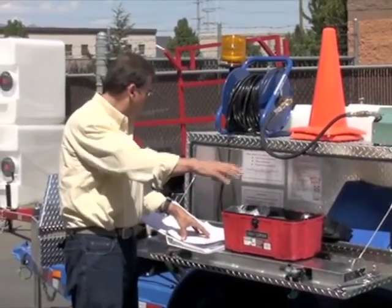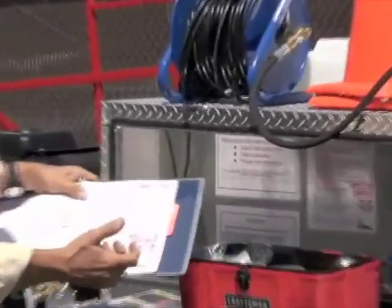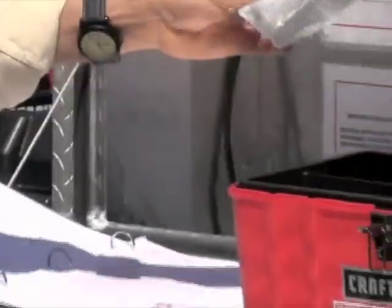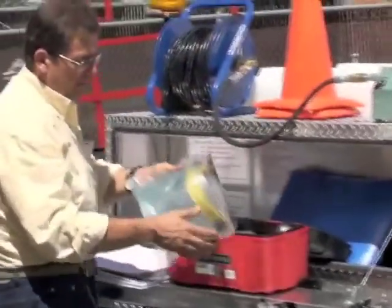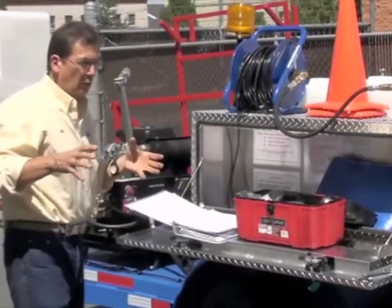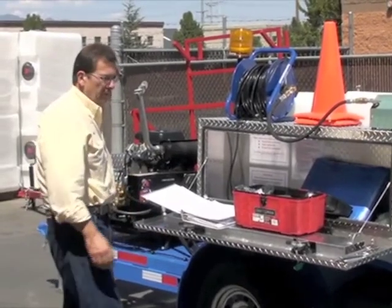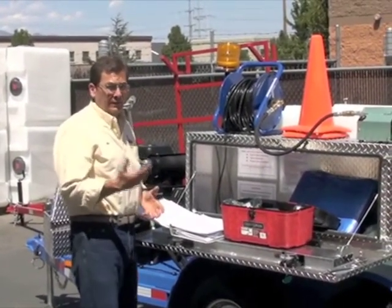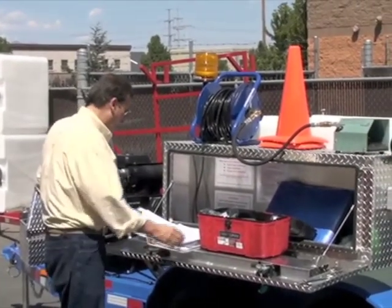The other thing to be aware of, and this is on our safety checkout sheet that's in this, is that when you're cleaning, you get a lot of backflow material coming back. So you want to protect your eyes again. Eye protection, or even a face shield. Provide your guys with the face shield. And take a minute and evaluate your location, where you're working at, where the spray is going to come at. Of course, ultimately, safety's up to the operator and the company that's training them. We'll try to give most all of that, best we can.